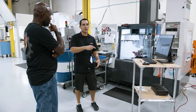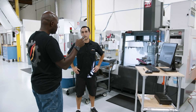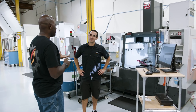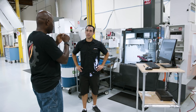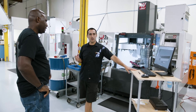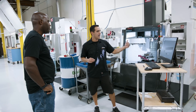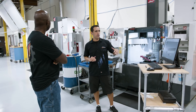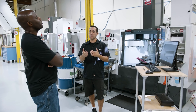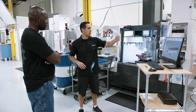He's not going to his office, programming, walking. Are your machines wireless — on a network — or just USB? With drip feed, I've had it skip a line, skip a section of code. What RF is going on in the area? We pull out a blank USB, plug it in, load that file — there's only one file. If we were pulling off a network or drip feeding, did we pick the right number? That's a lean term called poka-yoke — making things mistake-proof. We mistake-proof it by having a blank USB; once it's moved, next time we put it in, it just erases it.